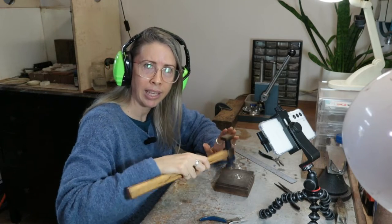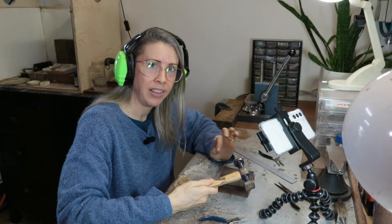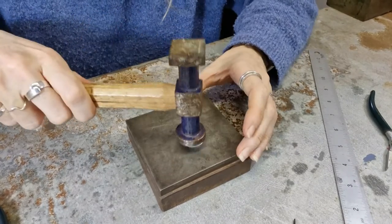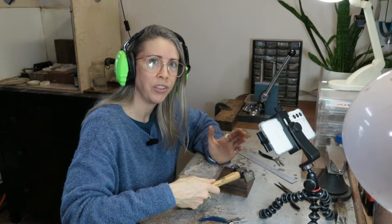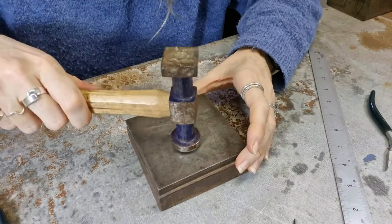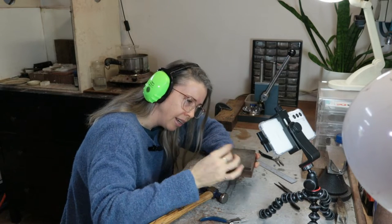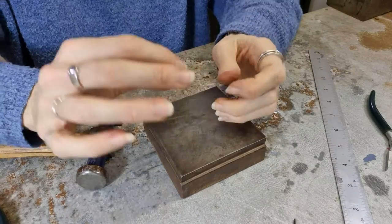You want to be gentle - tapping here, not smacking at it. Use gentle small hammer strokes because this is soft sterling silver, it's quite malleable and you don't want to hit it too hard, spread it too far, and make it too thin. The point of the hammering is to harden the metal so that it will stay where you've put it. I then pick it up and look at it on the plate to make sure it's not uneven or unflat at any point.